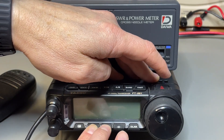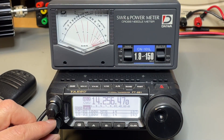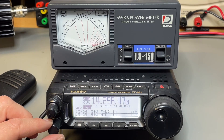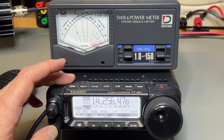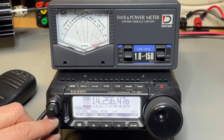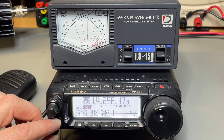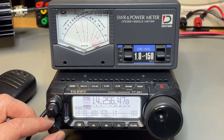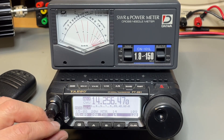So I'll set all the power levels. I'll add the 100 watts setting for 14 MHz, setting TXG to around 145. Let's put them all around 145 and fine-tune later. Now the 50 watts — did that. Here the 20 watts — 145, more or less. Let's do this one then also.